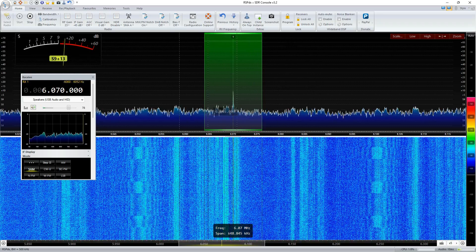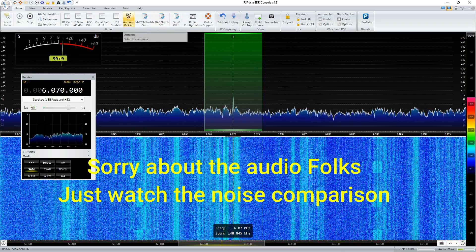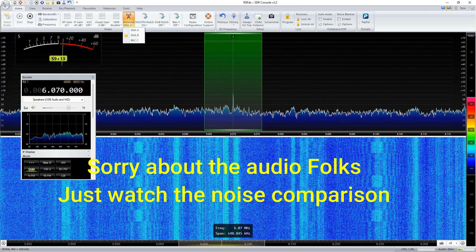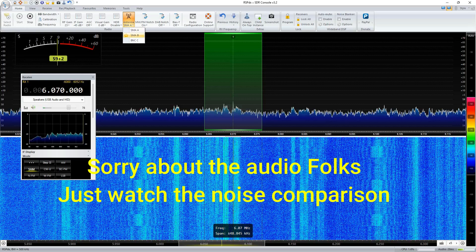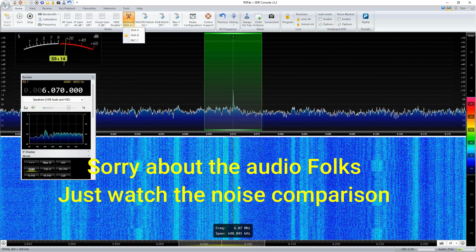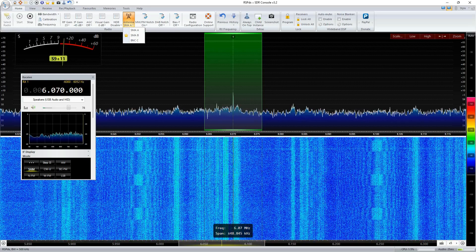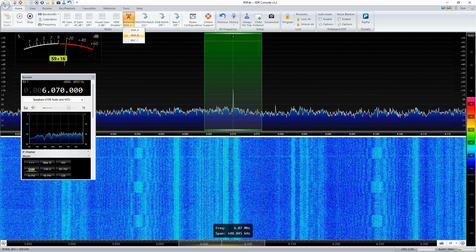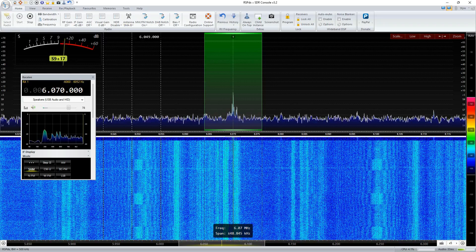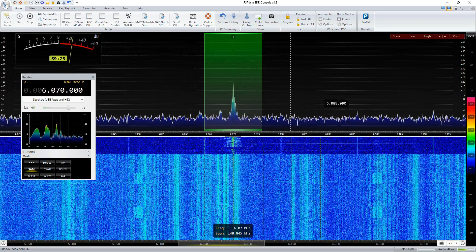You can see in the center of the screen a tiny little signal. I'm going to switch — this is the A antenna, which is the dipole, and the B antenna is the loop on the ground as I described earlier. There's also a 20 dB gain preamp in front of it and I'm using the SDRplay. The loop antenna is 125 feet or so away, so it's physically remoted from the noise source, which is the solar panel system.